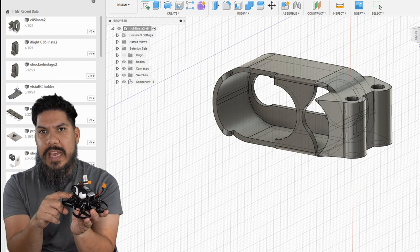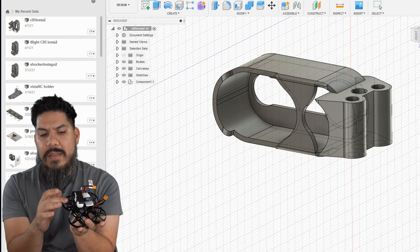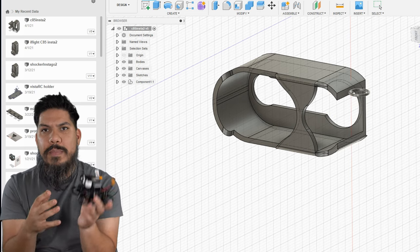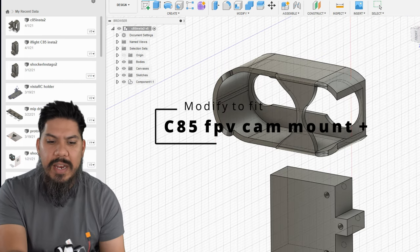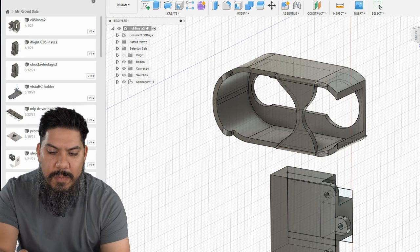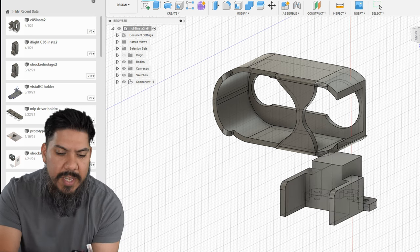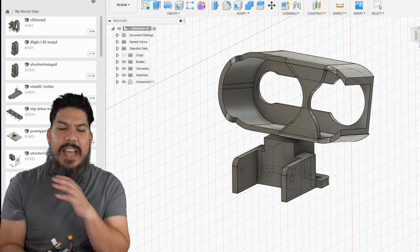I had to redesign the camera mount that would hold the FPV Nebula Pro camera, and then make a piece that would actually hold it, so it doesn't attach, it's all one piece. And I would have to replace the one that came with it, print it out. And I was like, do I really want to spend that much time helping iFlight out? Like, okay, they sent me the product, I do appreciate that. But I'm glad I did, guys, because once I did, that got rid of the jello,